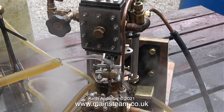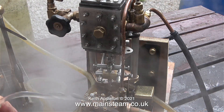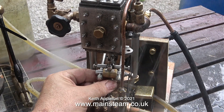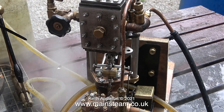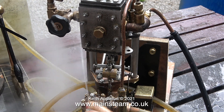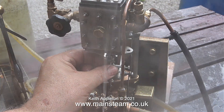This silicone rubber tubing that I'm using to test the water side of the pump has a very narrow bore. Here I'm testing to see whether the pump pumps the water against pressure. No matter how hard I try I can't stop the water from escaping from the end of the pipe — most of it's gone all over me. Here I'm adjusting the valve to compensate for the pump working against pressure. When I squeezed the end of the pipe the force of the pump would propel a jet of water about 10 feet, as you can clearly see, at quite a high water pressure. You can also see what a difference it makes as I adjust the valve when the water is pumping under pressure.